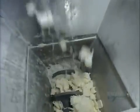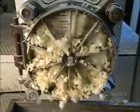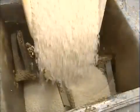Inside the next hopper, another auger turns. It pushes the soap through an extruder called a noodle plate that shapes it into soap noodles. As the noodles fall from the extruder, they're collected in bins, which are then dumped into a mixer.